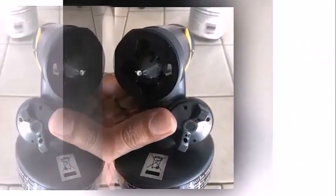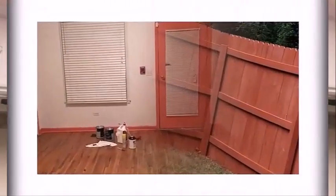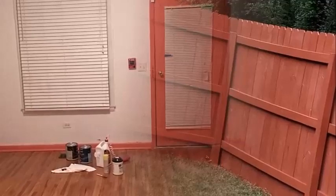The unit comes complete with two material containers — one quart for small indoor staining projects and 1.5 quarts for larger outdoor jobs. For a handheld HVLP machine, the Wagner Control Spray includes a viscosity-measuring cup, empowering you to decide whether your chosen medium requires thinning. Furthermore, the rear of the unit houses a replaceable air filter, preventing dirt ingress from ruining your paint coats and protecting the valuable internal turbine from detritus damage.